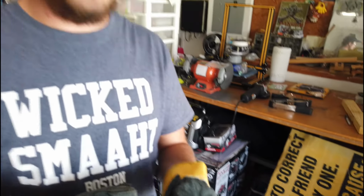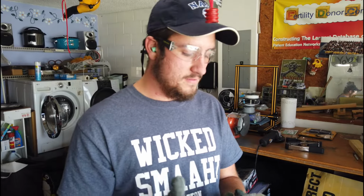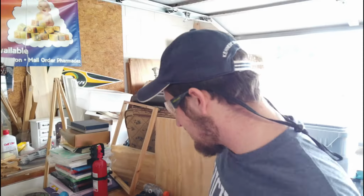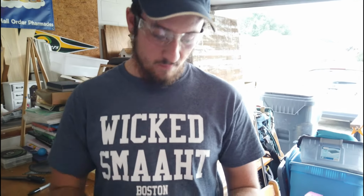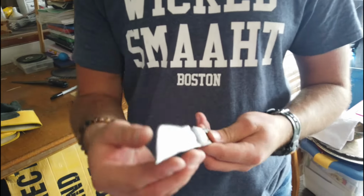And creating that edge is kind of tough, because grinding it on one side will push it a little too far on the other side, and then vice versa. So we're trying to create that straight edge all the way across. It's kind of tough. So we have this knife. We filed it. We've definitely got the shape out. All the bad edges are off. We've pretty much made it into a knife.